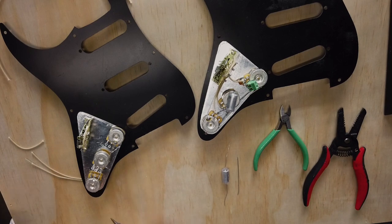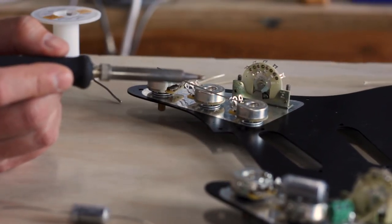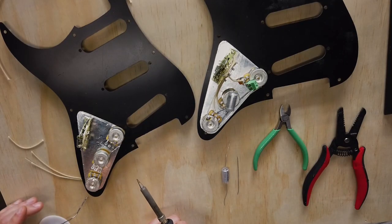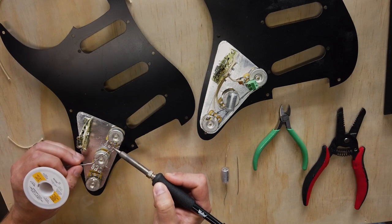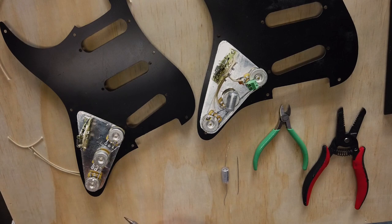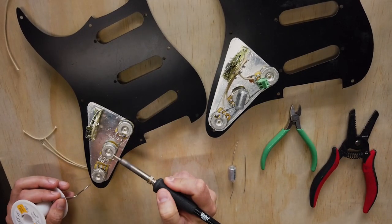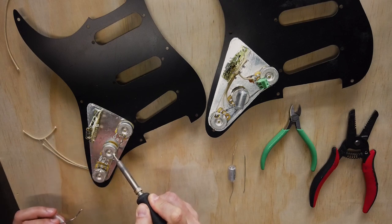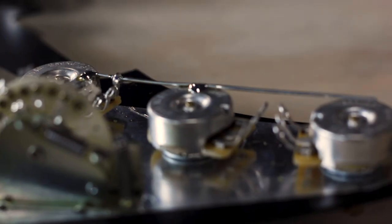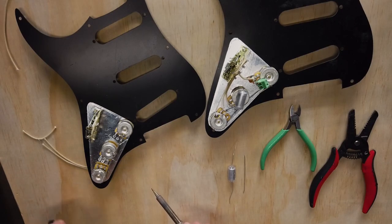You don't have to leave it sitting on there for long. The right kind of soldering is a feel — you got to look at it and pay attention. If it's too hot, the solder will just start to bleed out everywhere. If it's too cold, it'll just sit there as a bead and it won't actually flow. You want to get that temperature to where it flows out easily. Solder will flow down into things, so be careful when you're soldering lugs to make sure it doesn't flow all the way down into the pot or switches. I clean the tip before every connection, put the iron down, angle it across the wire and touch the back of the pot at the same time, and then you can see it flow out. And you never want to blow on the solder connection — you're getting a cold joint. You'll see it get cloudy. You want it just to cool off by itself.